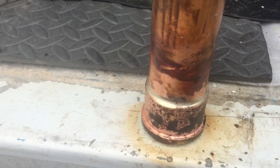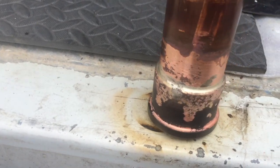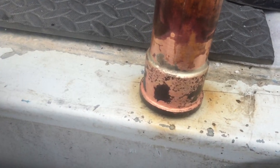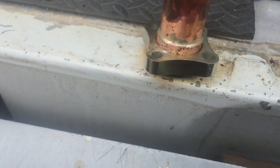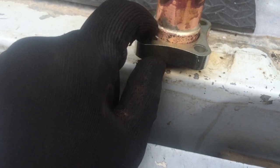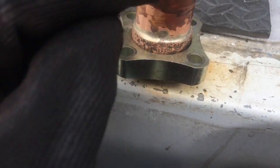I got my silver solder welded up on the back of the truck, then checked it for any flux pockets and scrubbed it out real good. This piece of the valve — the flange — you can see it kind of has a cone to it, but it actually goes in like this to help hold the gasket in. When you weld it up you've got to make sure you don't get any dribbles or else this won't fit over it. That came out really nice. Now I've got to cut this down to fit.